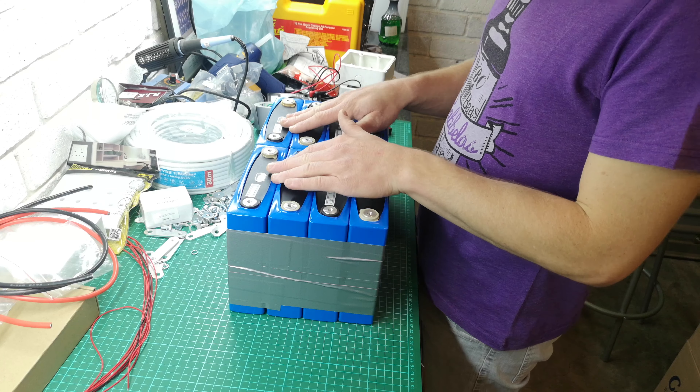The other thing people are sometimes worried about with lithium-ion batteries is they think about a cell phone battery - if it gets punctured, it explodes. But that's a slightly different chemistry. What these are is lithium iron phosphate batteries, or LiFePO4, and these are not as volatile as those sorts of batteries. If you puncture one of these, it's not going to burst into flames and explode, which makes them great for this sort of application - and it's another reason they get used in electric vehicles. For your house, also pretty safe. They also don't release any gas like some lead-acid batteries, which can release hydrogen - that can be a hazard if there's not enough ventilation.